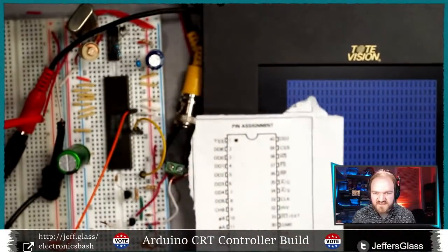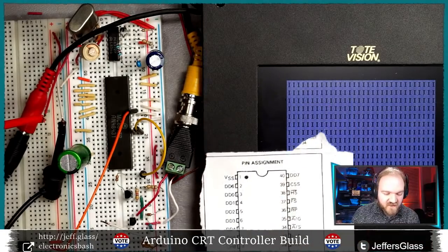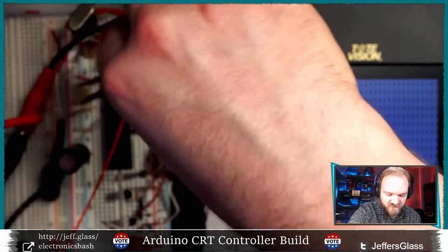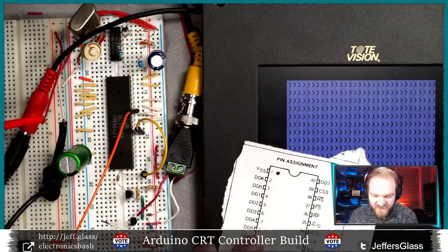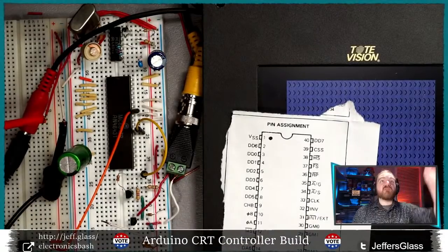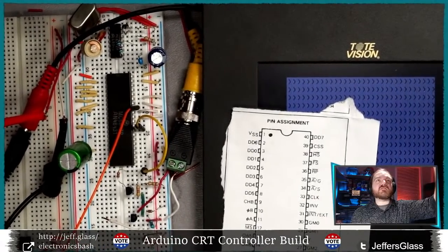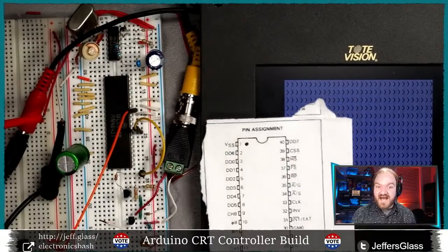And change it, and we'll see that now the collection of bits that I've identified is the letter I. We'll change another one. And again, I'm doing this more or less at random, but just to drive home the point that these pins are controlling the data going into the device. There we go. Now it looks like a close parenthesis symbol. So every time that this device is coming across the screen to draw a new character, the character that it's drawing is being set by the positions of those 8 pins, at least in this alphanumeric mode.